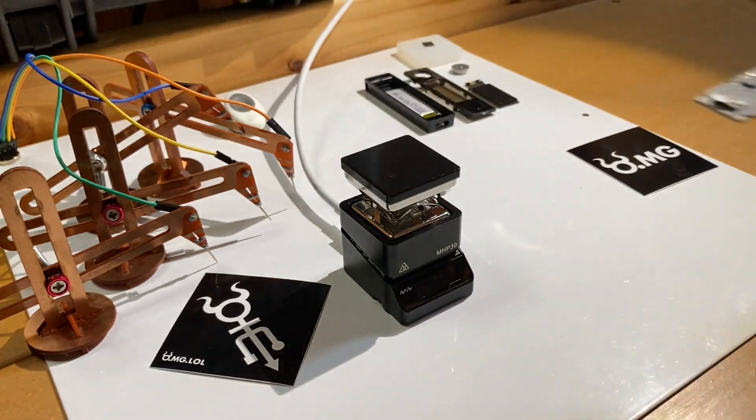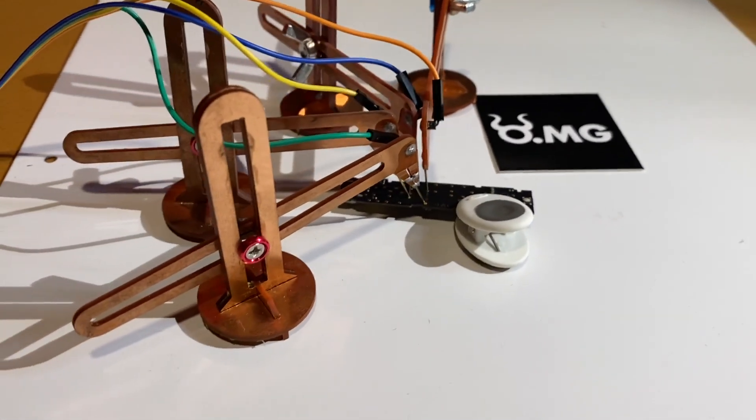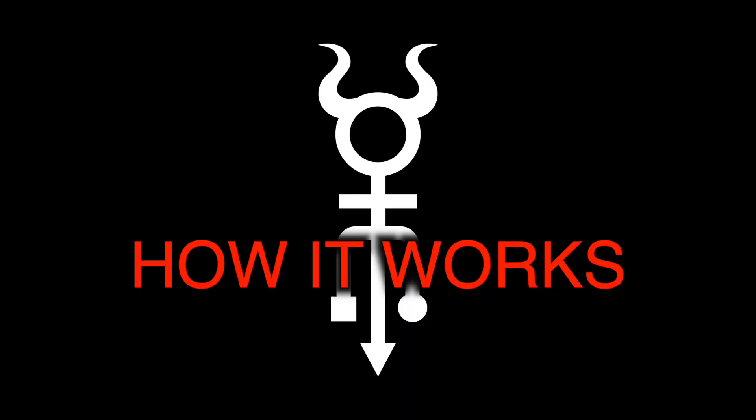At this point we just flash it using some custom probes I made via SWD. On this board there's an STM32 microcontroller that talks to the secure element — that's how the wallet works. But if you don't care about it being a wallet and just want it to be a thumb drive, you can do that too. There's already firmware out there for the STM32 that turns it into a mass storage device.